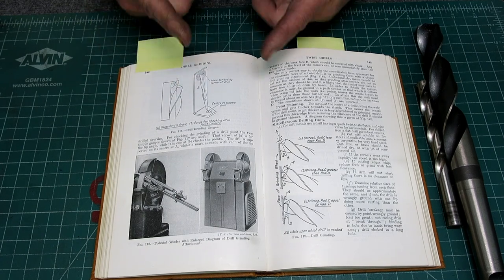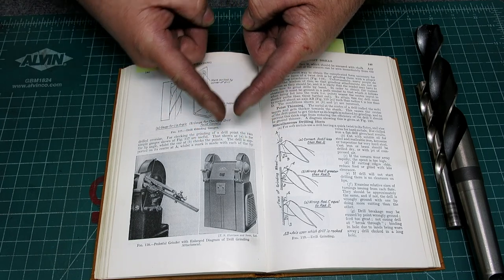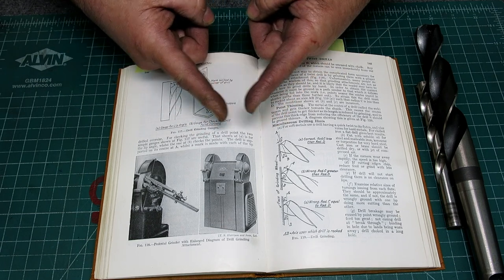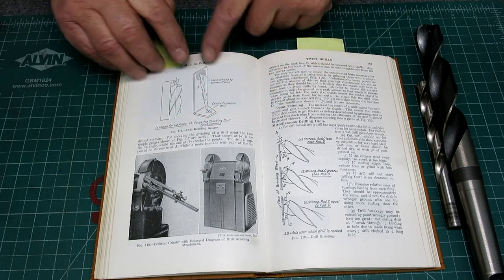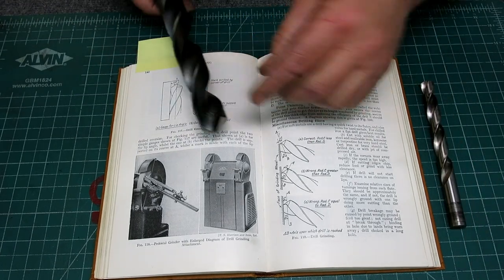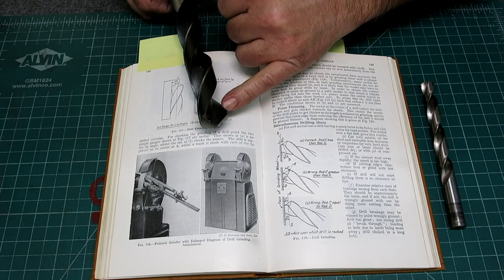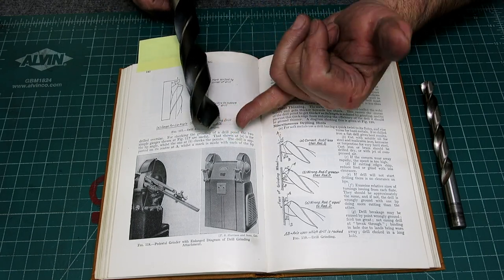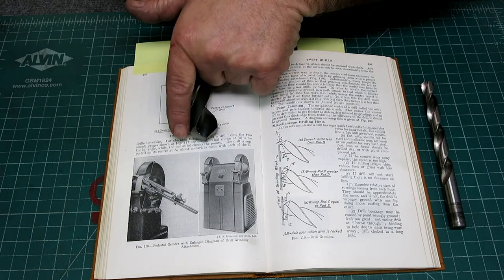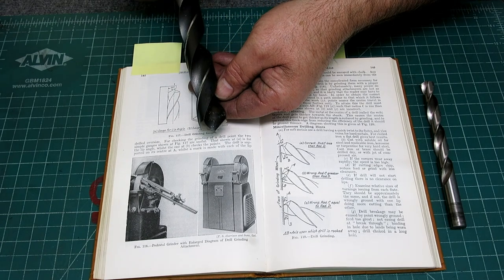And when you're sharpening a drill, if you get the angles off or the lip lengths the wrong length and whatnot, that shows up as a change in height in that cutting edge, right? And it's actually a hard thing to judge when you're grinding a drill by hand, because you're looking at the cutting edge on one side, but you're looking at the clearance on the opposite, so you can't directly compare those.